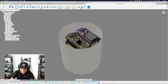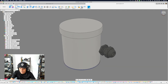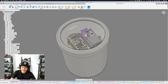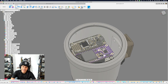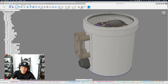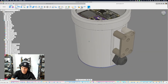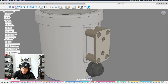Once we figured that out, we started working out the rest of the design details. At this point, I'm starting to create the top — the top of the enclosure is going to be a screw thread. This is a screw top, and I have a little piece of acrylic that I milled so you can actually see through it and check if the lights are blinking. The next thing is the mounting method. I originally came up with a 3D printed mounting bracket with tall standoffs, but it takes quite a bit to print because the standoffs are tall and the part is thick.